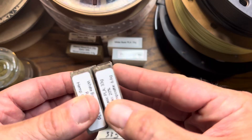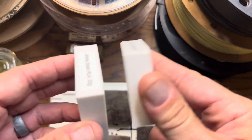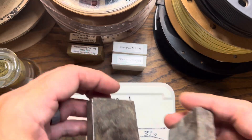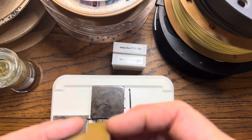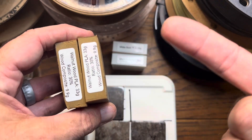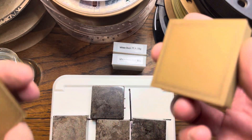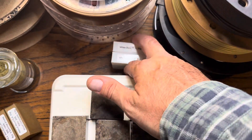What does this sound like? Plain plastic has a tinny, loud noise when you tap it. As you add composite fill, you can hear it getting more muted. The wood at 30% has a clearly muted sound compared to plain plastic. The more composite material you get in there, the more muted it becomes — because there's more of that other material dampening that tinny plastic-on-plastic noise.